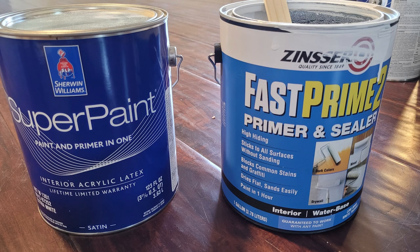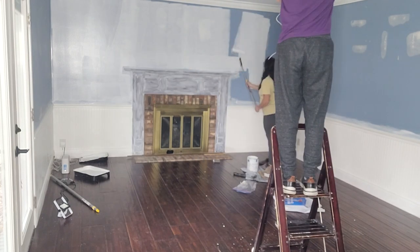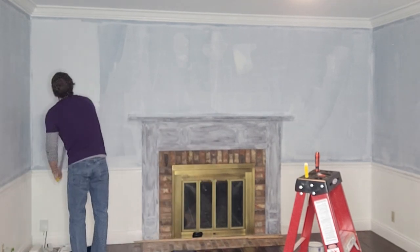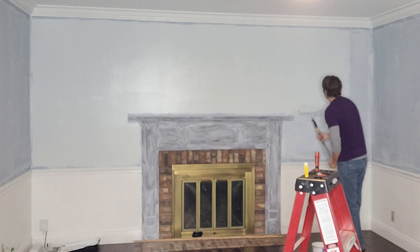We did go ahead and get the walls painted. We are using Sherwin-Williams Mountain Air, and I love this color. It's the perfect light pastel bluish — maybe a hint of green — and it just pops off the white so well without making it overbearing or dark. I want the space to feel really light and airy. We primed everything first with a cheap primer from my local hardware store just to tone down that dark blue underneath, so I'm not wasting expensive paint covering it in layers. It took one coat of primer and two layers of the Sherwin-Williams.